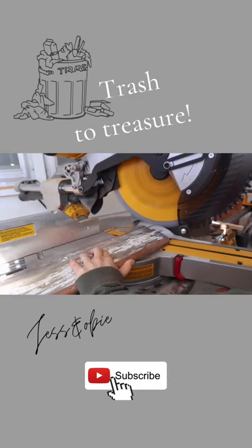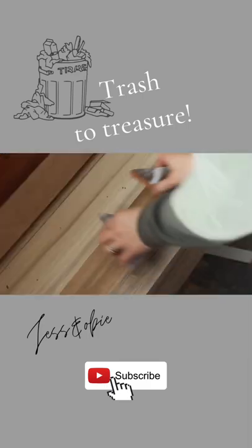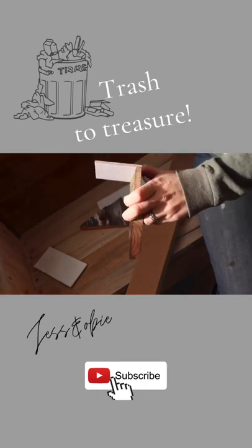To start off this project, I turned my miter saw to a 20 degree angle and then cut two A-shaped boards. Then using some scrap Luan wood, I cut two small boards for the roof of the birdhouse. Then I drilled a hole in one of the boards and I grabbed my nail gun and began nailing these pieces together.